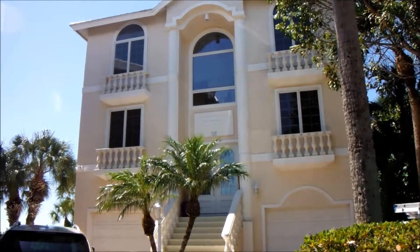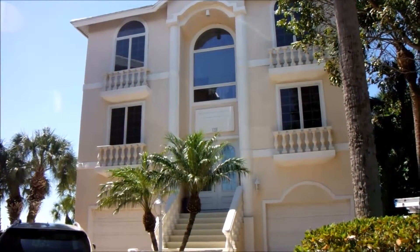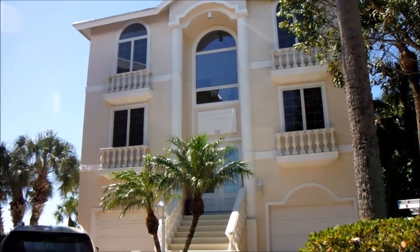This is Connor Galvin, a project manager with Kelly Roofing, doing the tile roof inspection here at 125 Sheldon. Inside the attic I did find staining and some rotted wood right here on the plywood, and where that is coming from is from this 8-foot off-ridge vent here.